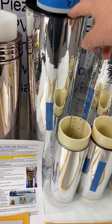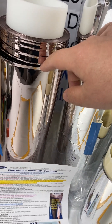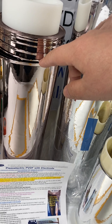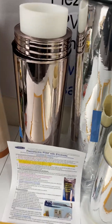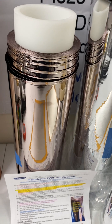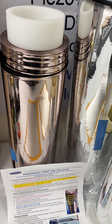With different roll widths, this film can be up to 450 millimeters wide. We also have a sputtered copper-nickel electrode on both surfaces, also better than one ohm per square. The copper can be etched with a ferric chloride solution, diluted to one or two percent, just like making your own PCB board.